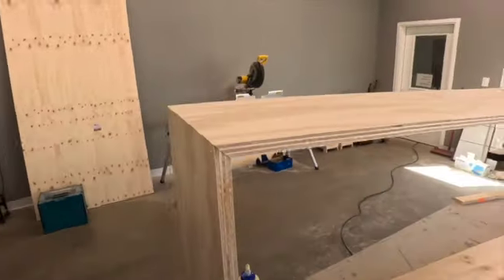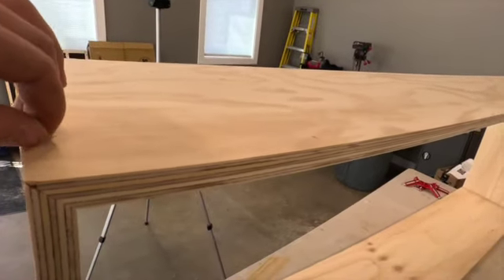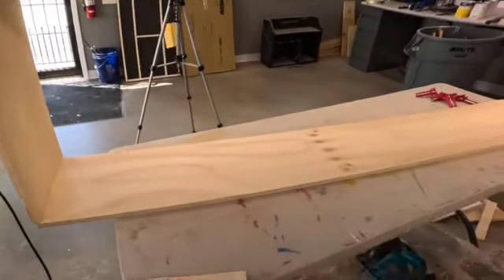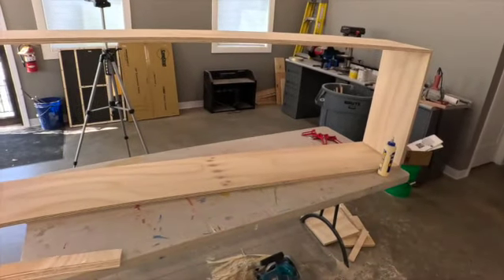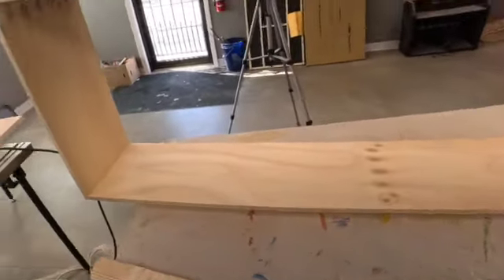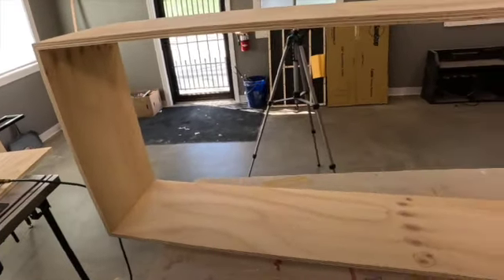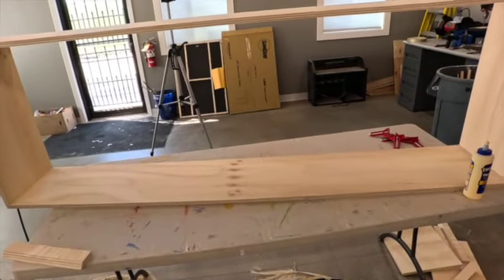So we got the frame here all put together. I think the miters turned out somewhat decent — some of them might have a tiny little gap, I think the worst one was that side over there, but the rest turned out pretty good. I'm the impatient woodworker, so I got some brad nails in here. I didn't really feel like waiting; I can just wood fill them and sand them, not a big deal. I'll probably do three sections — there'll be doors here, doors here, and the middle will be open so you can put consoles or a DVD player behind the cabinet doors on either side, and the middle can be for decoration.